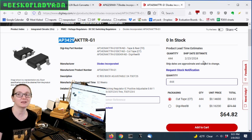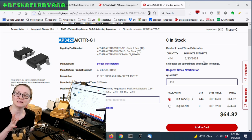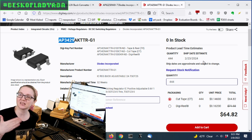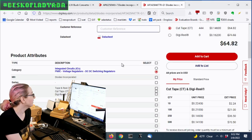Sometimes if the lead time is four or five months, it's like, well I need to find something today to keep production going. But this is so far ahead that I'm actually going to look for parts that are similar in functionality, even if they might not be pin compatible, because it's worth it to do a board re-spin. If I'm waiting more than two or three months, I'll just spin the board, get a new stencil — not a big deal — but I want to keep the overall functionality the same.